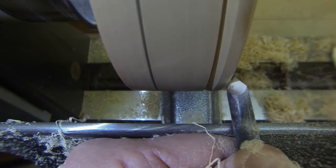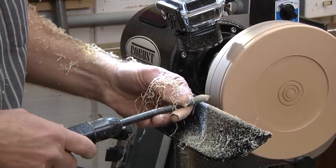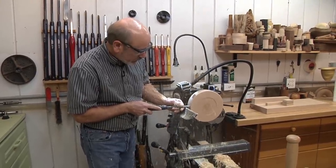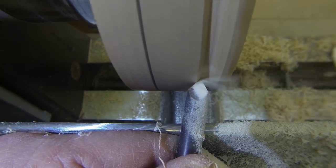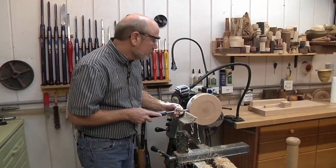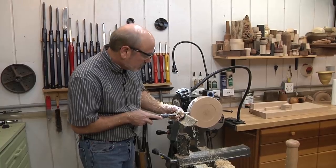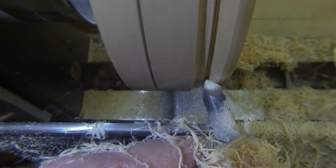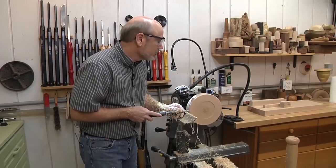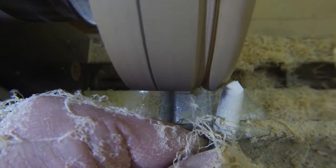You can take it and just curve it around as you go, breaking the edge. The shavings are flying — it's like it's snowing. I've almost got my bead shaped the way I want it. I'm going to take away some of this wood to get clearance for a cleaner cut. When you're making the beads, make sure the intersection here and here is perfectly clean — no tool marks — because this is end grain and you can't sand that out easily. Using that point tool you can get a really beautiful edge.